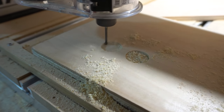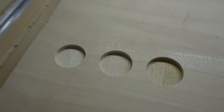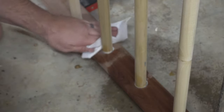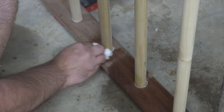One thing I still needed to test was the hole size for the poplar dowel I'd be using. I got these one-inch dowels from the home improvement store and was expecting a little variance in each pull, so I did a hole diameter test. After testing these dowels, I decided to go with a hole size of 1.05 — I didn't want to make the hole super tight because I wanted room for wood glue.